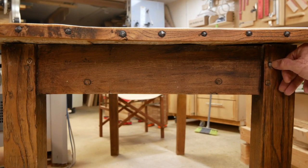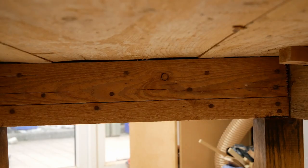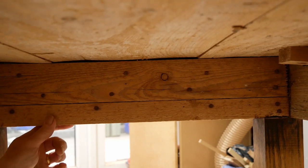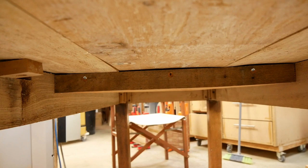If we look at the apron and the leg and the joinery — gapped and become loose — because somebody's driven a nail in, what looks to be just a wire nail in the end to try and secure it. There might even be two nails there, and there's another one at this side. Underneath the table at the end they want cut off, it looks as if somebody's taken a piece of three by one and a piece of two by one and a half by one and literally nailed it in — absolutely horrific. And then looking into the middle of the table there's a piece of six by two, seven by two, been skew-screwed up into the tabletop in an attempt to stop it twisting and sagging.